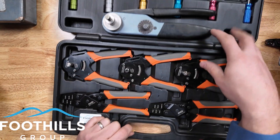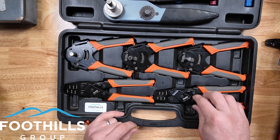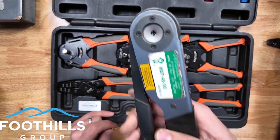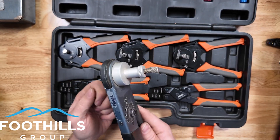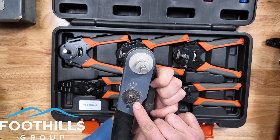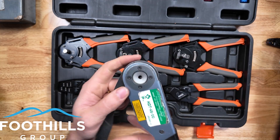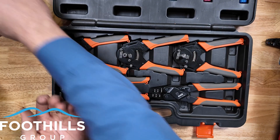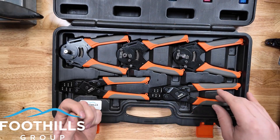This whole kit that I got here has extractors in the top row, closed barrel crimpers, and open terminal crimpers — all for $180. Value-wise, you'd have to do a lot of closed barrel crimps to notice the difference and make the $600 pliers worth it. What is nice about those is they're all internally indexable, from 12 gauge wire all the way to 26 gauge, by simply pulling and adjusting. It changes the depth the crimping fingers go in, and there's also a depth stop on the back side to make sure your crimp lands in the middle of the barrel.